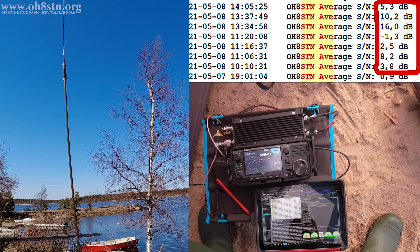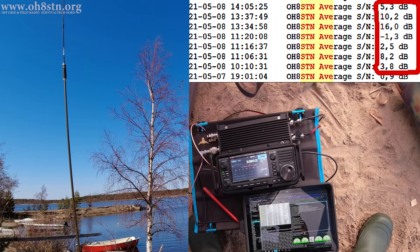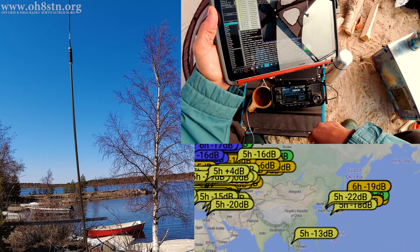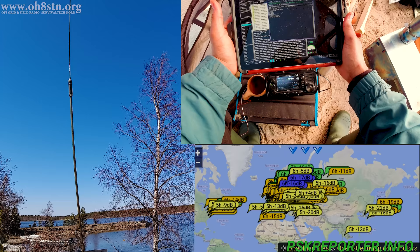While I was out on Hailuotho, I did some tests with Winlink Vara HF. I alternated between using the amplifier and using just 5 watts — it's pretty easy to see which is which from the chart coming from OH6 India Juliet. I also did some tests with JS8 Call and FT8. The most impressive of those were with FT8 — six consecutive QSOs to Japan. My station wasn't just transmitting; I was actually being heard and hearing those same stations from all over the globe.